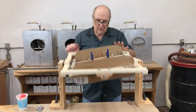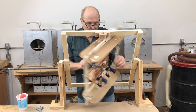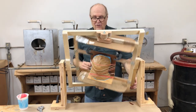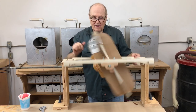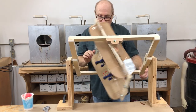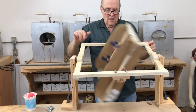Now I'm going to focus a little bit more on the bottom of the mold, because in the last shot — because of the leak from the screw holes — I focused more on the top half. So here I'm keeping the resin more down in the torso part of the mold. There's very little balancing needed here because this mold is relatively light. When you get up to really huge molds — life-size, body-size or bigger — then you're going to spend some time balancing the mold. But not now.